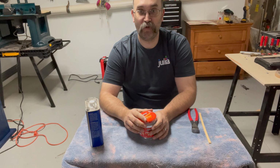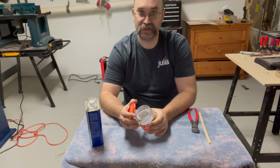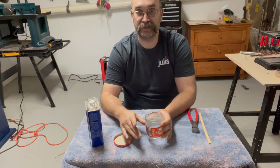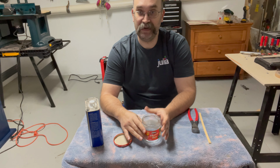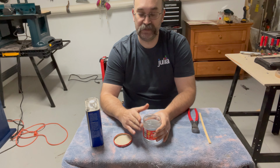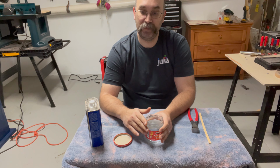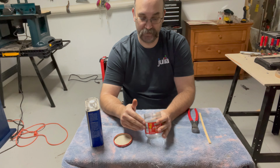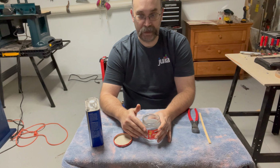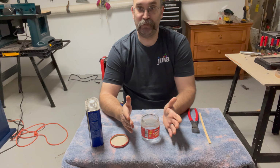I was trying to avoid having to melt binding and acetone to use as a fix for the binding I've already installed, but unfortunately I've got a few dents in my binding. Rather than scrape the binding so thin to level out the dents, I'm going to build up those areas again with some melted binding and then scrape it off. Hopefully that will make everything look like it's supposed to.